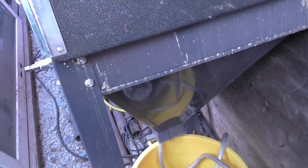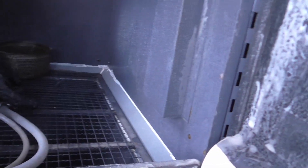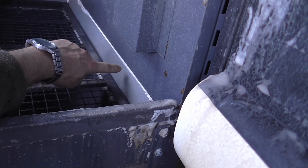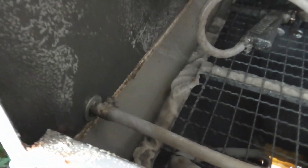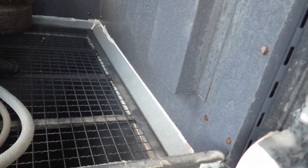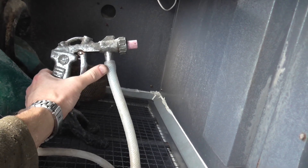So we'll have a look inside the cabinet. The only modifications I've made are this piece of rubber held on with adhesive tape that helps keep liquid away from the seal on the side here. I've also got this 45 degree angle piece — just some PVC plastic siliconed in — to get rid of the ledge. You can see down the front here the media just building up on horizontal surfaces, and if you've got the original ledge you end up with a lot of media just sitting on that ledge.